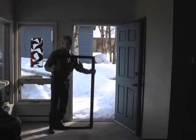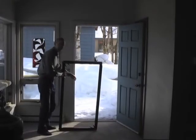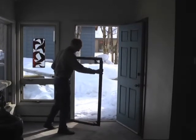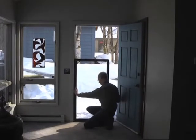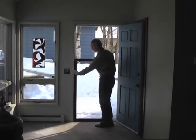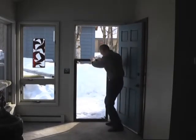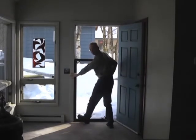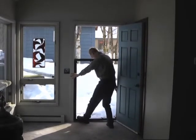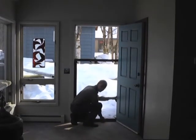Make sure when you install it in the doorway that the adjustment knobs are facing inwards towards the house. Note that the reference hose is already outside. The first thing I'm going to do is align this on one side of the doorway. I'll loosen the adjustment knobs for the side-to-side movement of the frame, then, holding this side to the doorway, extend the other side over and tighten the adjustment knob.